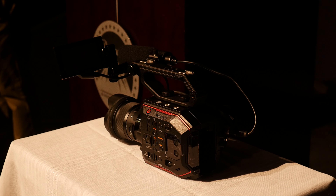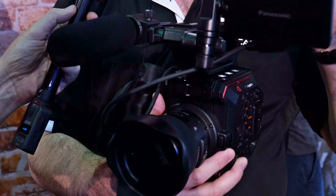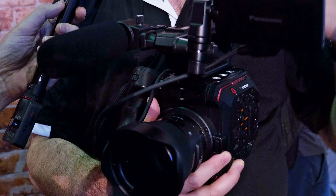Other features we've put in here — we have something in our VariCam cameras, which are very high-end cameras, called dual native ISO. A lot of people don't quite understand what that really means. Dual native ISO means that we can run the sensor and read the signal from it in two different ways. The standard way that everyone does is our lower sensitivity, and then we have a fundamentally different way of pulling information and reading the sensor that allows us to get a much brighter signal. On the VariCam, it's 800 ISO and 5,000 ISO — a 2.6 stop difference.